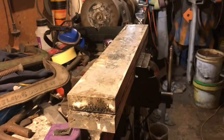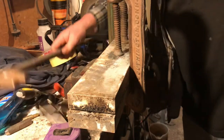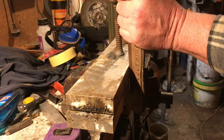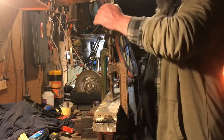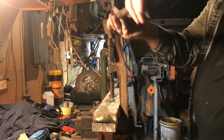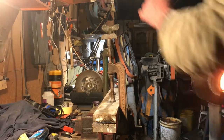One plate on top of the other — as I stated in the other video, this helps me keep a nice straight knife. It doesn't warp when I cool it this way. You only try to quickly straighten steel one time and you learn that's not the way to do it. Putting it in the quench plates keeps it nice and straight. I'm just going to tighten up the clamps with a lever to help keep it in the right position. I don't mind putting some force on it while it's in the clamps.